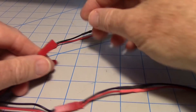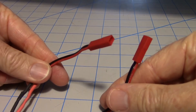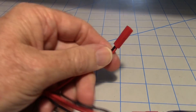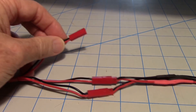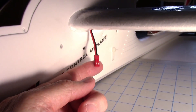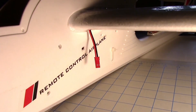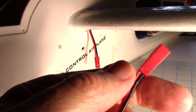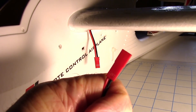On the splitter cable, two of the connectors go to the wings using the two cables you made up for the wing lights. The third one goes to the LEDs in the tail; that plug is inside the fuselage. Here is the plug for the tail lights and here is the plug coming down from one of the wings. I cut a small hole in the side of the fuselage for this connector, making the hole big enough for the narrow part but not the bigger lip on the end.